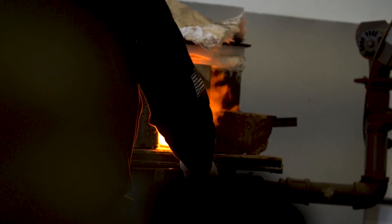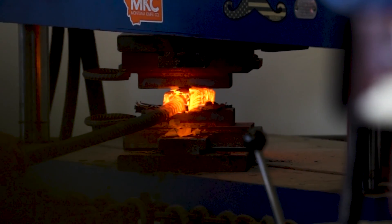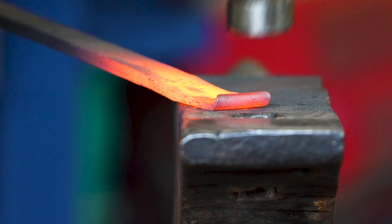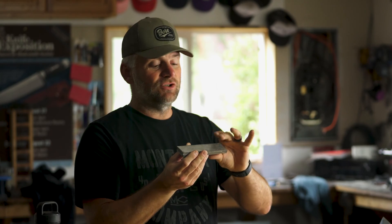We need to heat the steel in a forge until it gets to its forge welding temperature. If we heat the steel up to only 1800 degrees and then press or hammer it, it is not going to bond properly and you're going to end up with flaws — it will all fall apart eventually. This steel has a magic welding temperature of around 2200 to 2300 degrees Fahrenheit. When you reach that temperature and let it soak through the entire billet, then apply pressure with a hydraulic press, mechanical hammer, air hammer, or trip hammer, that pressure will actually fuse the steel together and it will become one.